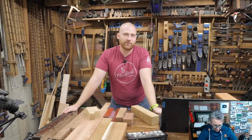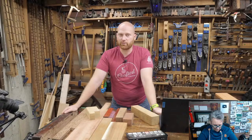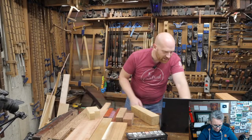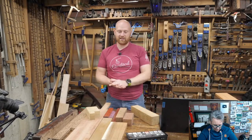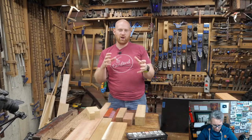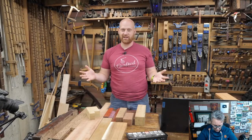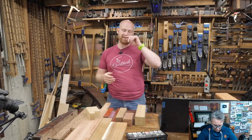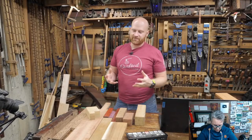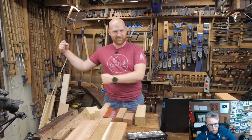Make sure you're going with the grain at all times with ash. It's a relatively durable wood that will stand up to a lot of abuse. It is a very light-colored wood and stays light — it doesn't darken as much as other woods. Most oaks have a lot of tannin in them, which tends to give them a golden, richer tone as they age. Ash has a very similar grain structure to oak but doesn't have much tannin, so it doesn't change to a darker color in the same way.